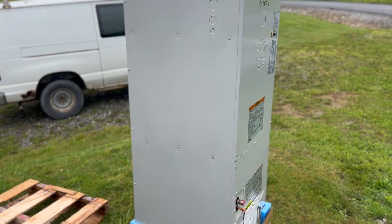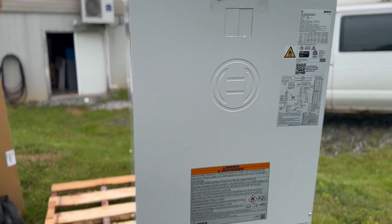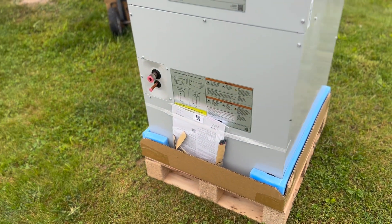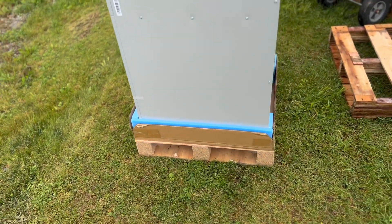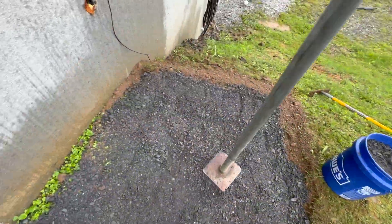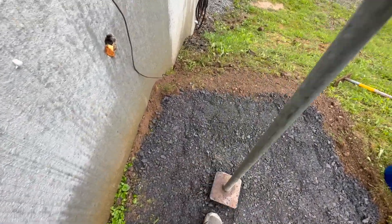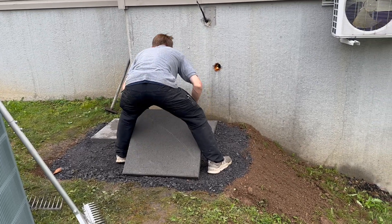Here is the brand new Ultra Series five-ton on four-ton combination. This is a 19 SEER2 rated system and it does run on the R-454B mildly flammable refrigerant. This system is also capable of communicating, so it can be hooked up as two-wire for the control system. We are resetting the foundation — tamping the soil and the gravel — and Cadence is taking her good old time setting those pavers for us.